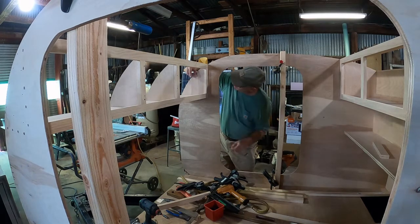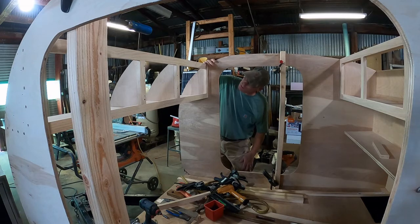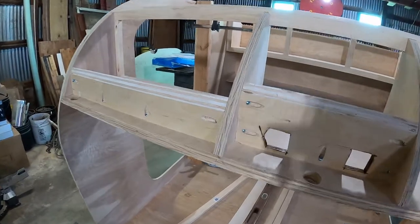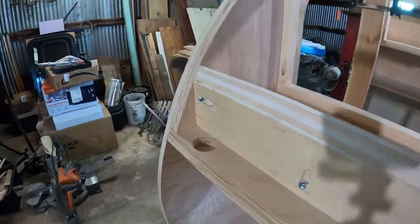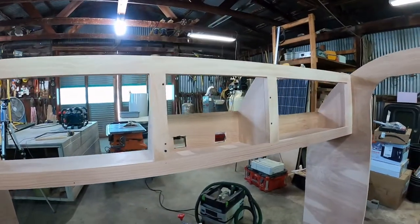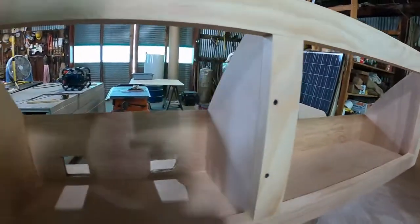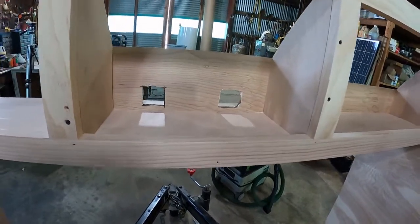So that means a little bit of a backer on that, and a backer here, so that the wires aren't seen. I got my backing in for my wires and my switches. From this end it looks kind of ugly, but I even got my holes drilled. All these holes are drilled extra wide — wider than the devices themselves — because you have to actually get the device out. I've got to make a plate that goes over the hole that the device attaches to. I could have screwed these in permanently, but then if there's ever trouble you'd never be able to get them out.